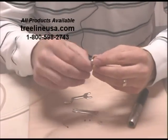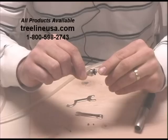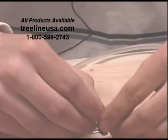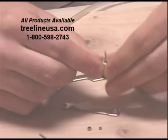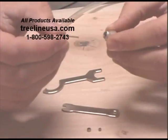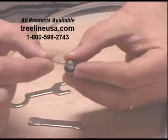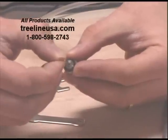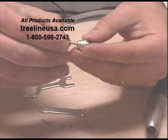Next, take the bit out. Notice on the back, this area right here is extended out. Turn that flat on its back like this, push straight down, and that will release the bit. Then use the back end of the bit and notice that little circle right there in the middle. Push the bit into it, and by doing that, we'll remove the collet.